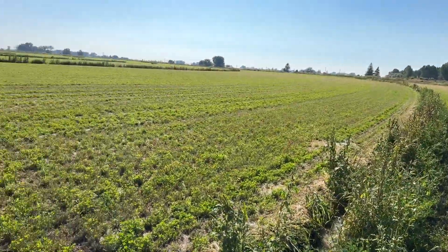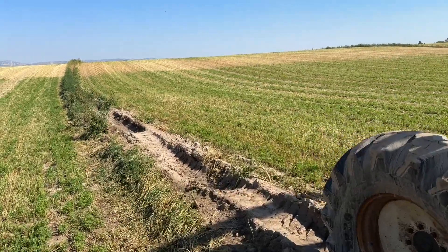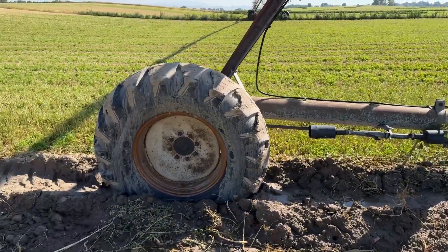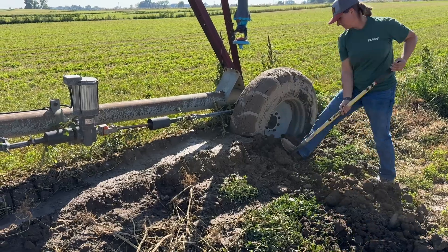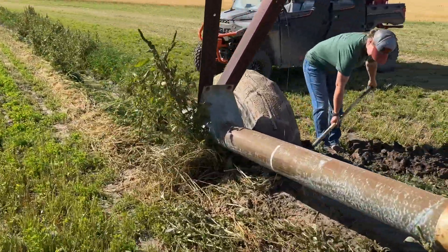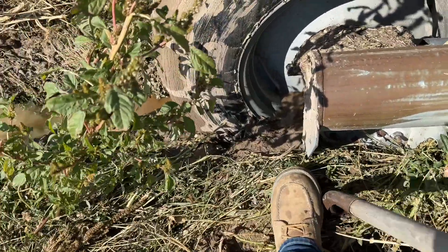This is a normal shovel — that's just the depth of the water. But it's got a deep rut here. This pivot we call 'the hills' — it just has a little hill in it — but it all runs down. You can see right here it kind of goes up and down depending on how fast the pivot's going, and the mud kind of runs down the hill after it goes past. Then it builds up a little bit, and so this tire is not really stuck but it's trying to climb a hard spot that's half as big as the tire. And on the other side of the pivot, we can look and see that the gearbox right here is dragging in the mud.